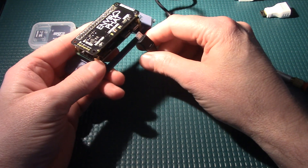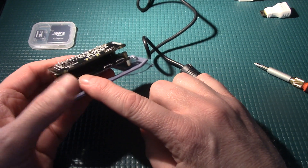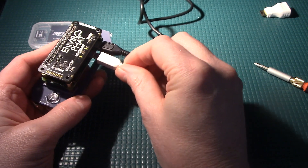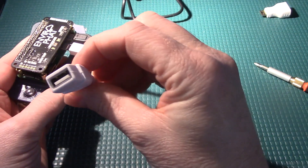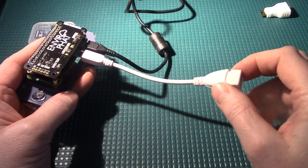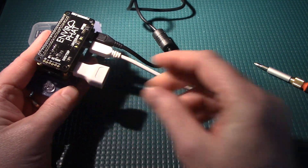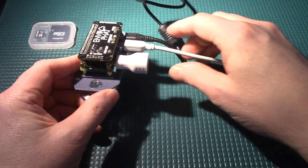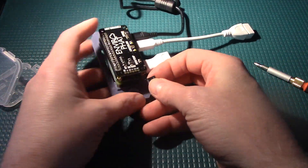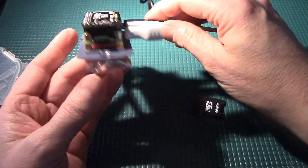We have the power supply, the USB, and the micro or mini HDMI. The power will go in here. Just for setup only, I'm going to put my micro USB adapter here so I can use my little wireless keyboard mouse adapter to do the setup. But once it's set up, I'm not going to use this, and same goes with this HDMI adapter — this is for setup only. The last thing we need is just the micro SD card. I don't have the Raspbian OS loaded yet, but I just want to show you where all the parts go — so that just goes there.